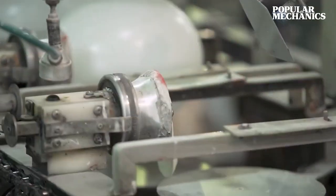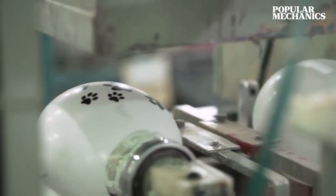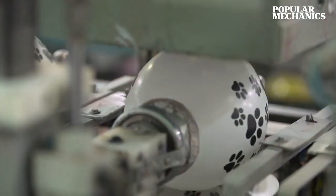If you want a more intricate design or pattern on the balloons, the balloons are manually placed and hooked into a special machine. They are then inflated with jets, where a printing machine gently applies the designed pattern to the balloon, changing the angle of application to cover the entire balloon.